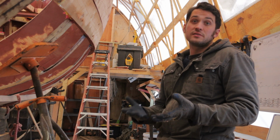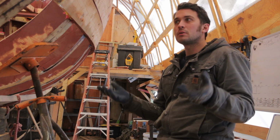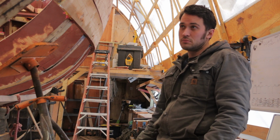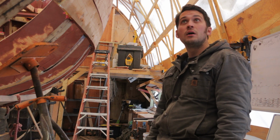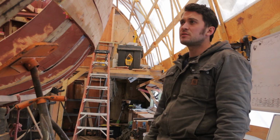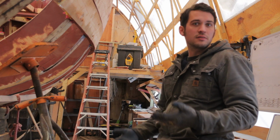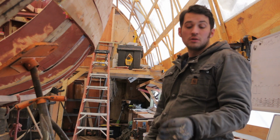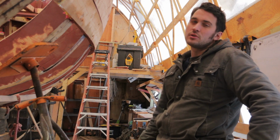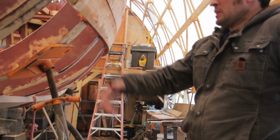They're probably, I think, one of the worst for resisting extraction loading, in that they're only working on friction, and while it's comparatively a lot of surface area, so it's comparatively a lot of friction, it's still only friction. So, again, I've never actually seen a trunnel fail against extraction forces, but I'm entirely willing to believe that it's possible.